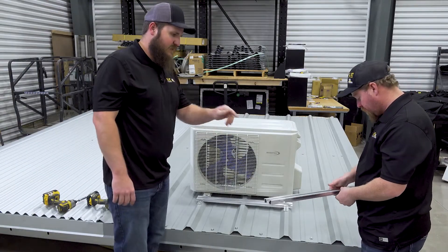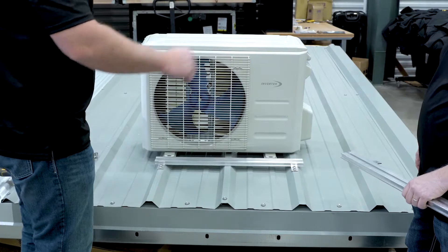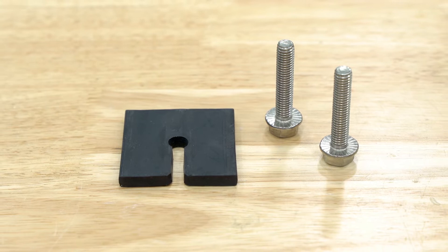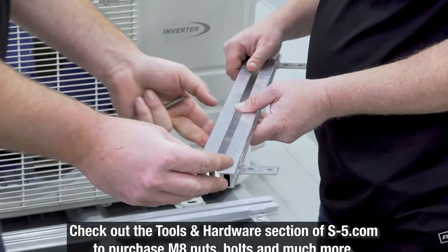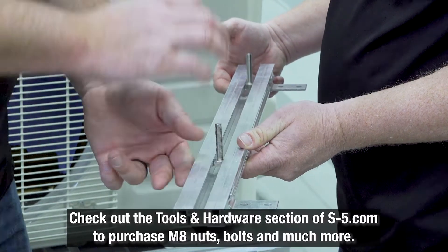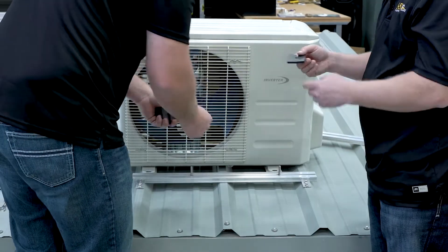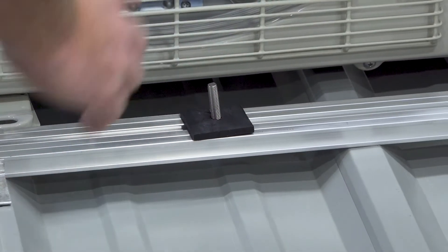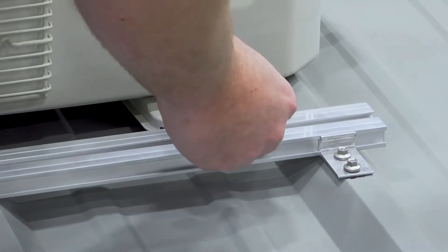Much like last time, we're going to take the next piece of GripperFix strut that's going to sit on the feet of the back of the unit. We're going to start assembling those, sliding the tabs in. For this one, we're going to be using our 40mm serrated stainless steel bolt along with EPDM pads — slide these into the slots just like before and get ready to assemble everything together. This is a good time to install our EPDM damper pads; they just slide over the fastener and are slit so you can loosen the bolts and adjust later. We're going to do two on the downslope side and one on the upslope side.